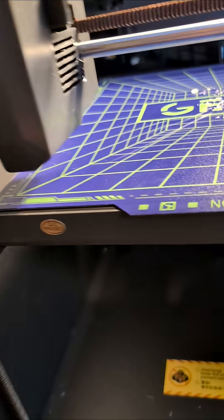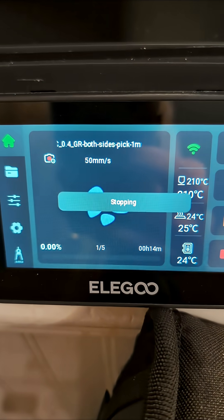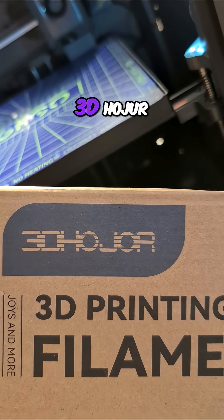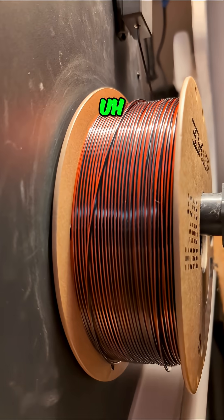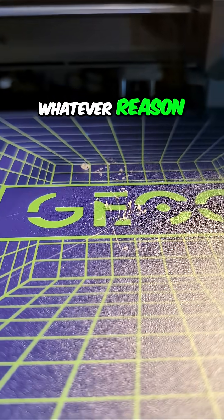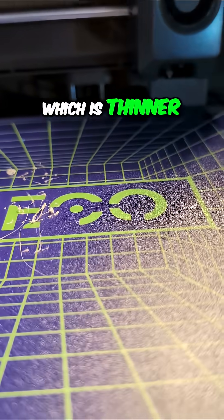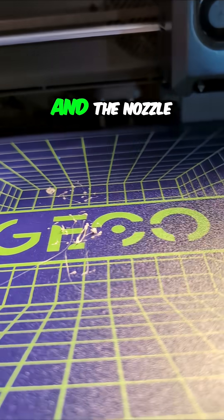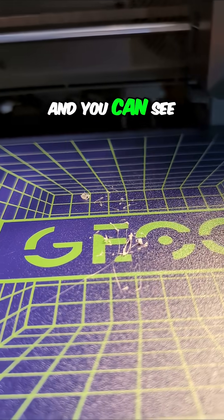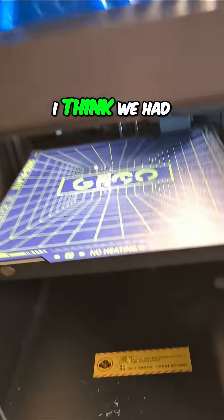This is a new one. You can see that it goes a little bit into this print of six guitar picks. Doing a first run on this 3D Hojor PLA silk red and black. And for whatever reason, it's acting like it's on the other build plate, which is thinner. The nozzle was so close that nothing was coming out. You can see we're on red and black, but white's coming out.